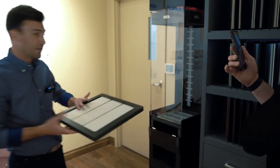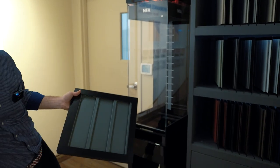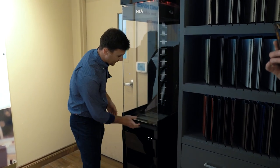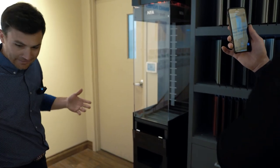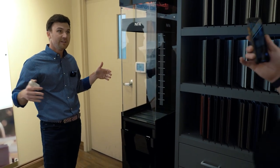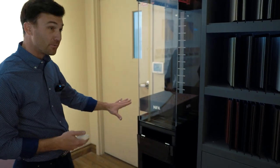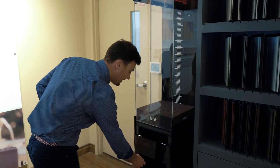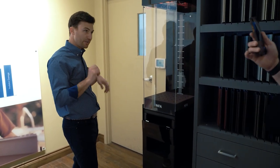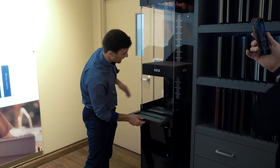I'll show you one other one — this is our hidden vent. This is not our highest NFA and you can tell because there are a lot fewer holes, but it would still allow you to meet code on a 12-inch overhang, which is what we measure on. When we install it, it still holds a high NFA. It would exceed code for a 12-inch overhang if you're using a ridge vent that requires an 18 NFA. This one still gets you there — not quite like our fully vented — but it allows the same ventilation needed with a much cleaner, crisp line and a better look.